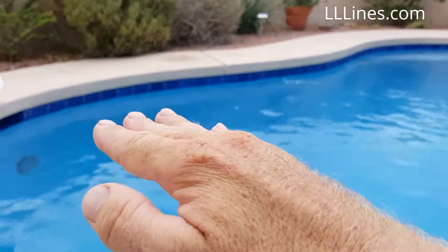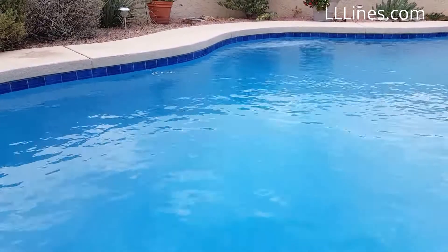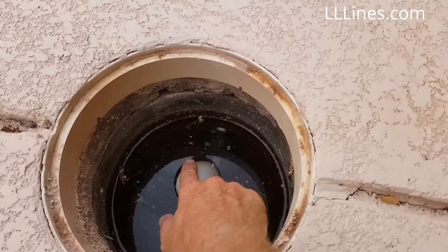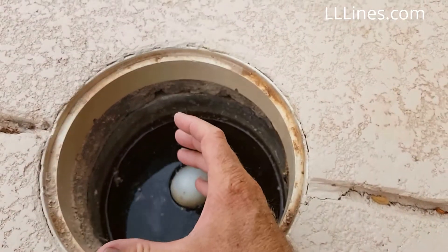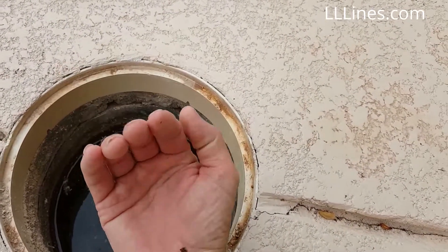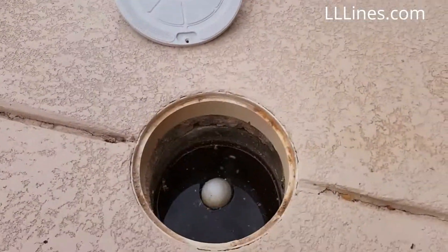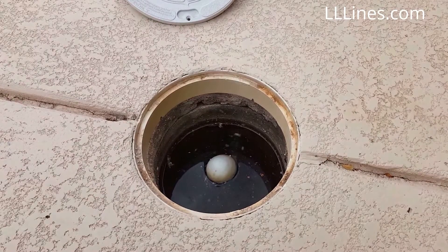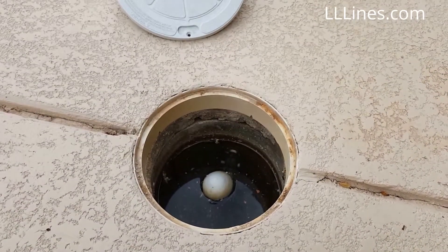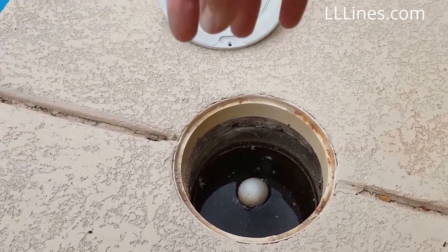You've seen them where they're even worse — right at the very bottom with barely enough water going into the skimmer. If you have to backwash at any time, it creates a problem because the skimmer runs out of water. These water leveler wells installed too low don't have enough working room to get the level up where it needs to be. Perfect example — these people can either have a new well installed after deck work and demolition...